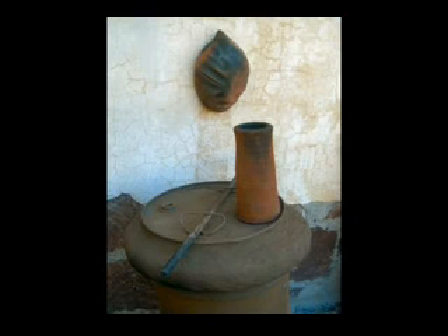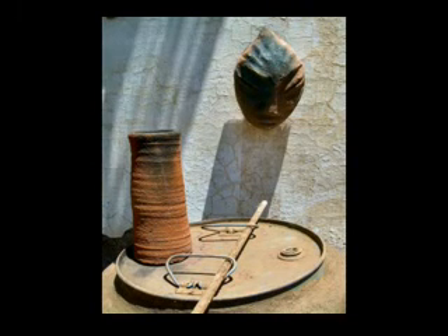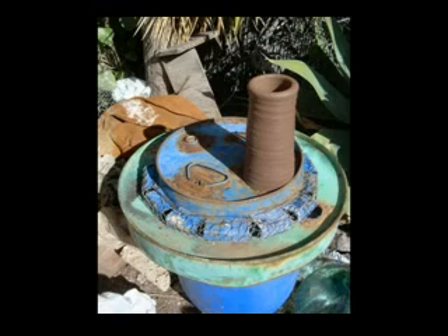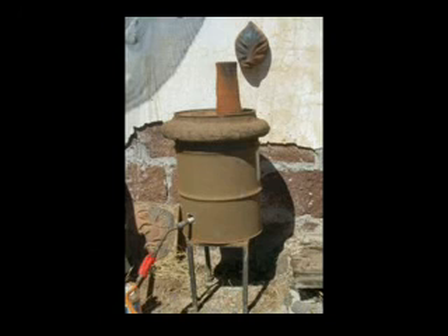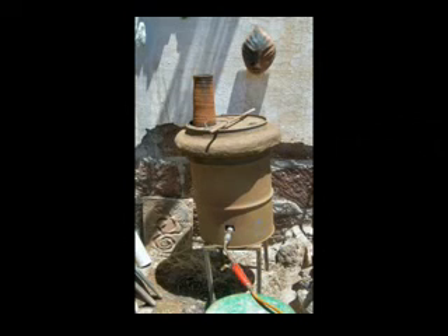It's much more complicated to make the lid than the body. I also supply the lid — the head of the kiln — with the removable chimney, with some bearing so that you can easily lift off the lid. You can make reductions; you can also make a raku reduction without opening your kiln. The only thing is that you put reducing materials like wood or straw inside the kiln to make the reduction process.